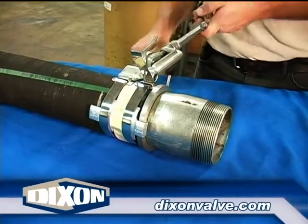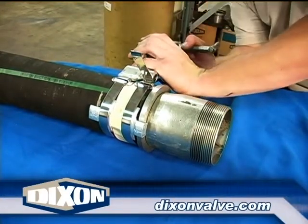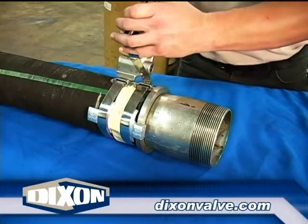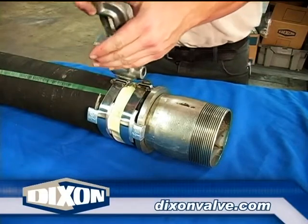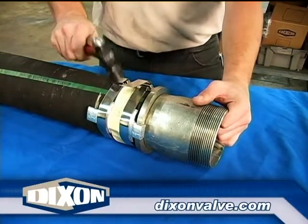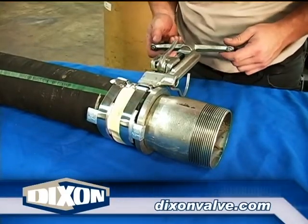Installation of clamp-it band and buckle using screw action tool — when proper tension has been achieved, follow the steps in procedure 2104 to cut and secure the clamp tail stub. Moving back to the clamp-it band closest to the hose end, properly tension the clamp, then cut the clamp tail and secure the tail stub as per the instructions of procedure 2104.